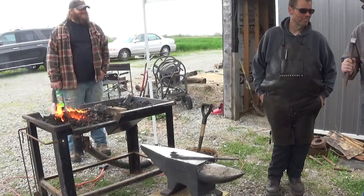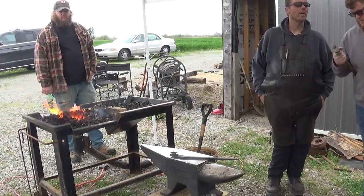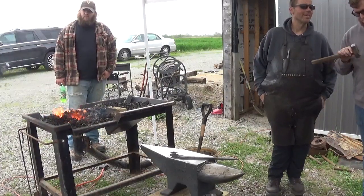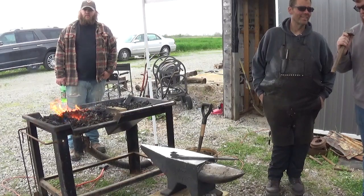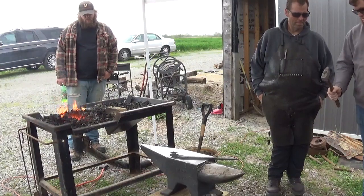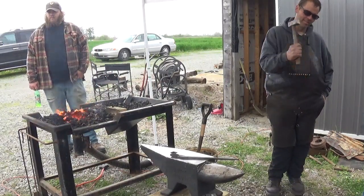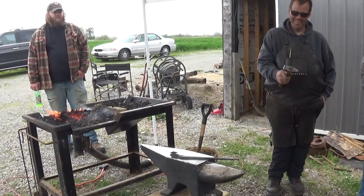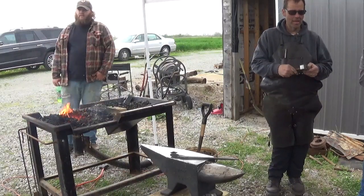We were instructed not to dress the bird's mouth by Tom, but to chisel in even deeper. That's the one I cracked. The bird's mouth actually kind of overlapped and protected it. Last year at the state fair, I sent everybody to lunch and I wanted to try to do a cleft weld on the bits on the tongs. I was the only one there — I'd pull them out and they'd squirt out. Finally a light went off. I held them with a pair of tongs together, set that bit down in the corner of the fire pot and held it there, started cranking it. When it got up to welding temperature, I hit on the end of that rein and it was set.